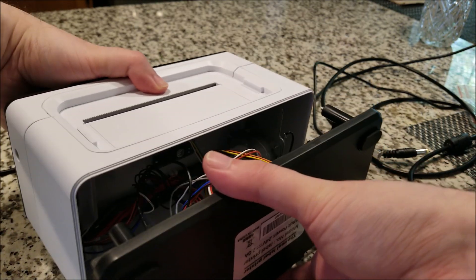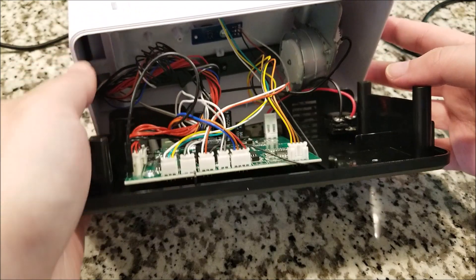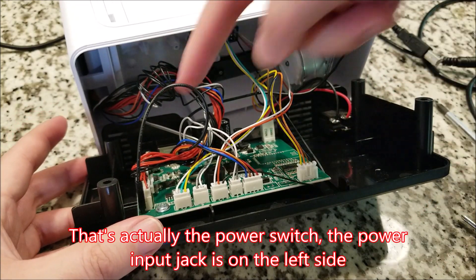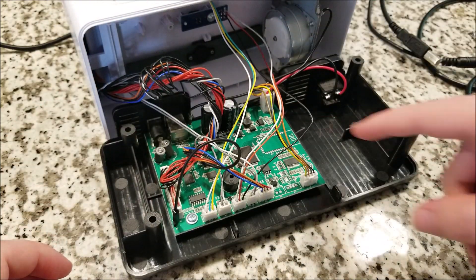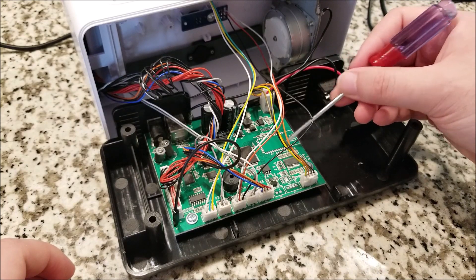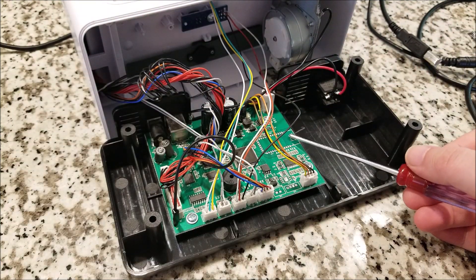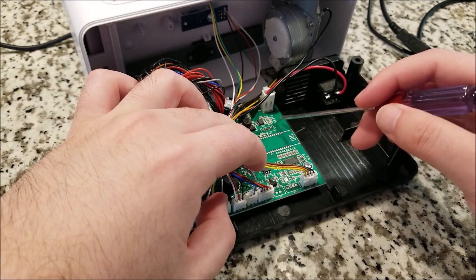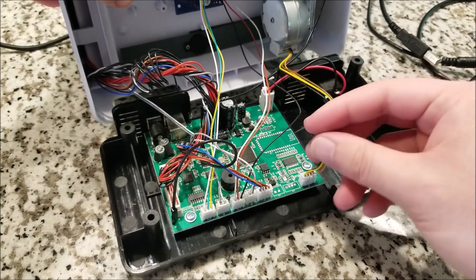I'd advise if you're going to get one of these for business, don't tear it open — that's why I'm doing it for you. We can see the AC input here. It's actually a pretty simple single board. Interestingly, there's a spot for a Bluetooth or Wi-Fi surface-mount sub-carrier board, so I'm guessing there's a higher-end model or they're planning to add wireless in the future. There are also some unpopulated headers, probably related to that wireless module.